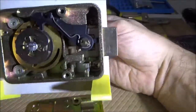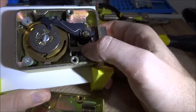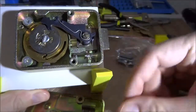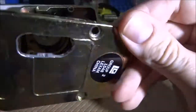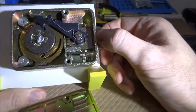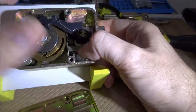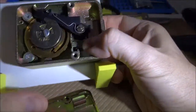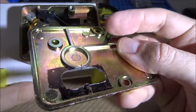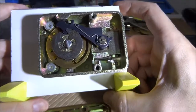Once the lock is closed, you cannot unlock it without the lid on, because of the relocker — the part that protects the lock from tampering and prevents the back plate from being removed. If the back plate is removed, you can no longer unlock it, so don't try to force it. All you have to do is depress the spring, and then the lock unlocks again. The lid contains a piece responsible only for depressing that spring.